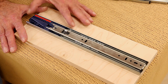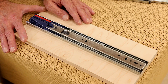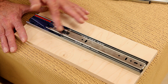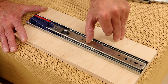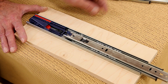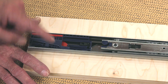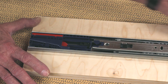What we're using here is a KV brand drawer slide, but there are a number of different brands on the market and they're all good. This particular drawer slide is a soft-close, self-close, and all the mechanism for that is back here at the back. The first thing you'll notice when you go to open the drawer slide is it's a little difficult for the first inch to inch and a half, because we're unlatching from the self-close mechanism and charging a spring - that's the spring that's going to close the drawer.